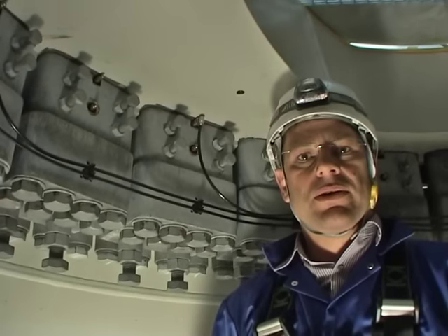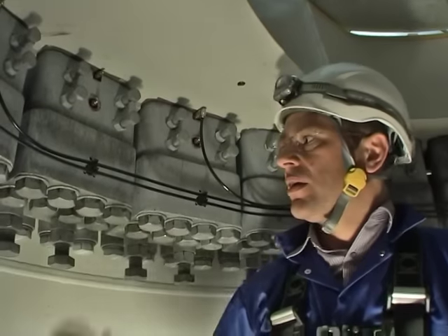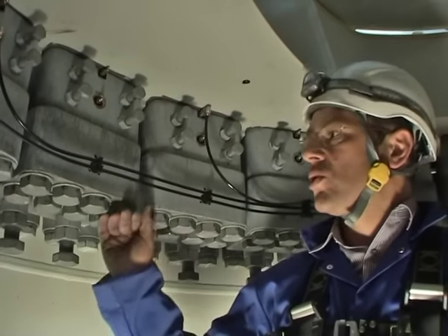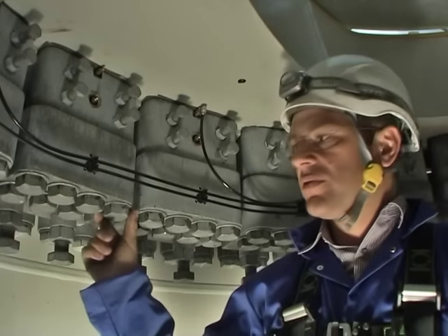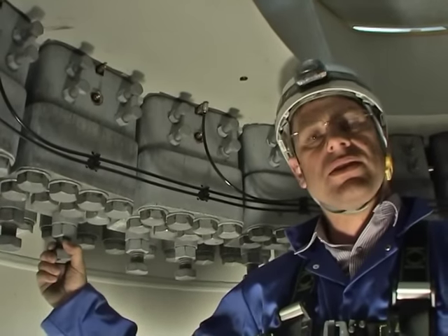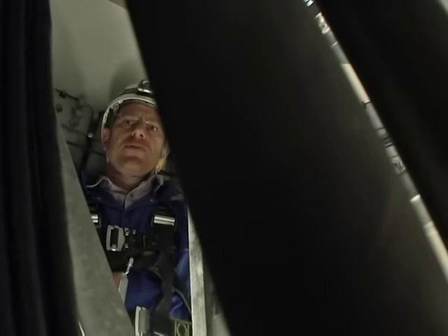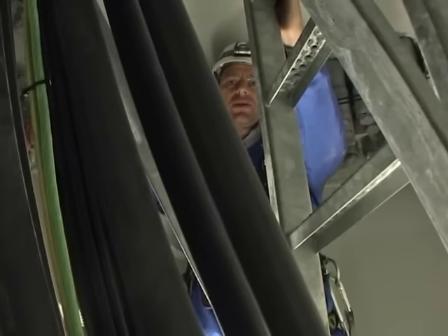So I've arrived at the top of the tower and the end of the ladder, and we're in a small cramped section called the yaw section. We've got these yaw claws. These hold the nacelle to the top of the tower, and there are 22 of these substantial pieces of metal clamped here around the top underneath the nacelle. The export cables come through the yaw section and then down into the twist section before carrying on further down the side of the turbine wall where they're exported.